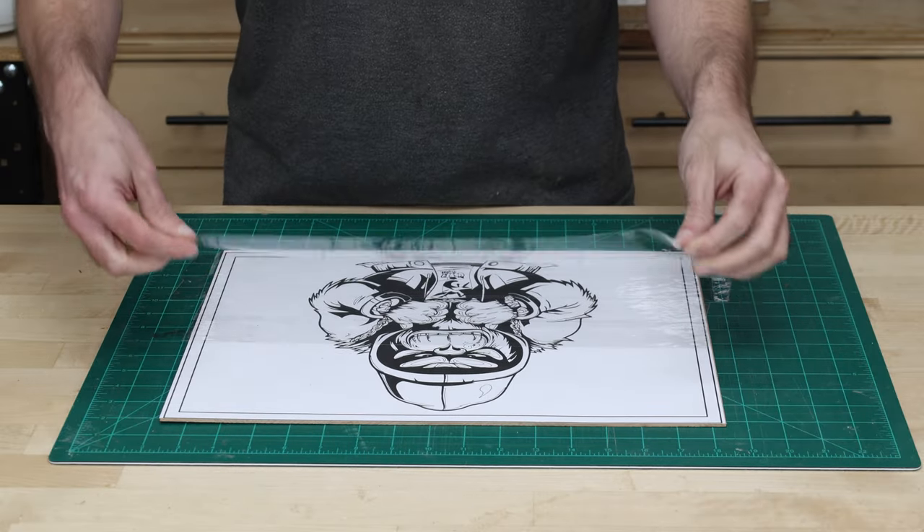I love putting on a fresh blade — look at that, it is shiny. No sanding required — that's one of the things I love about a crown tooth blade, that type of finish. Now that I've got the pieces cut out, I'm going to break them apart and peel off that blue tape, then take the sycamore and the walnut and glue them back together again to make one big piece. I'll use CA glue because it's fast. Then I put glue on the bottom of that piece and glue it onto my artwork.